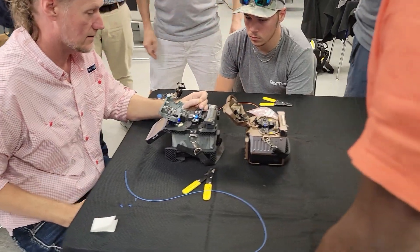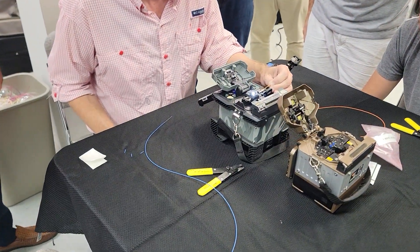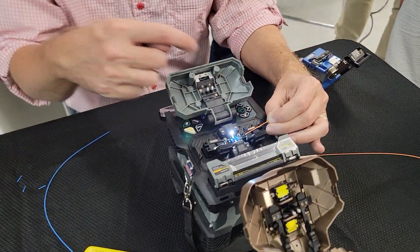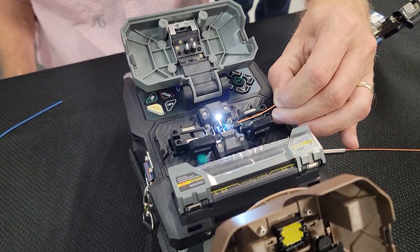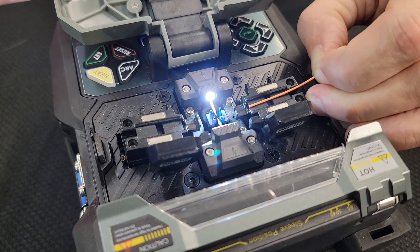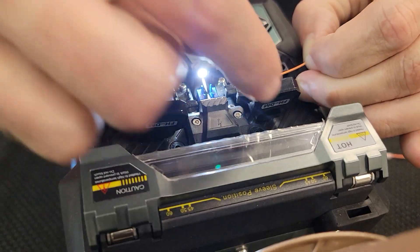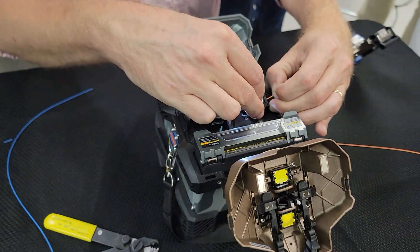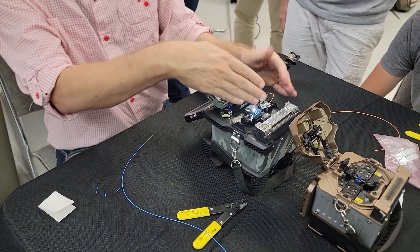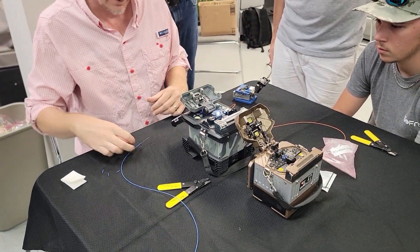Watch me. I've got my fingers pressed right here. I'm lowering my fiber into the V-groove without jabbing it against anything. Then from this point, I'm going to lower — I'm going to pick my elbow up. As I pick my elbow up, I can manipulate that fiber and get it to go where I want just by pinching my fingers together. When I get it halfway between, I'm going to clamp it down. If I leave a large amount of slack at an angle and I close that, it pulls the fiber back — so you mess up.